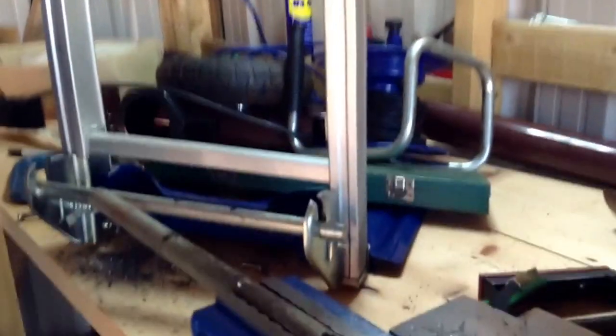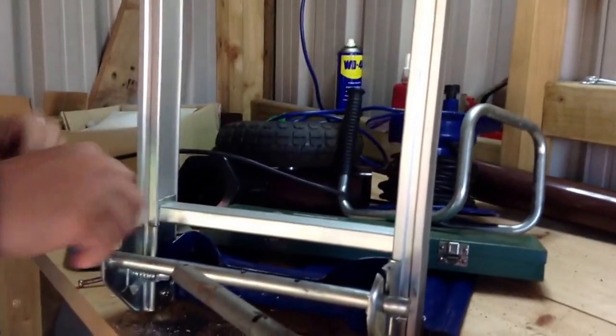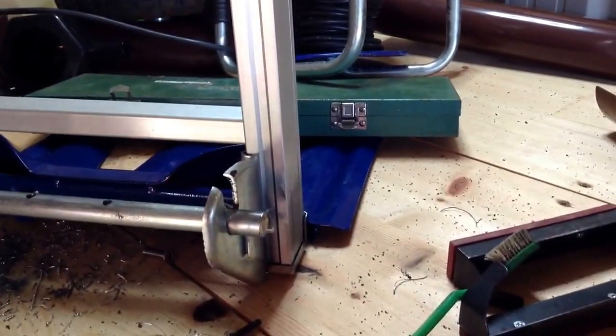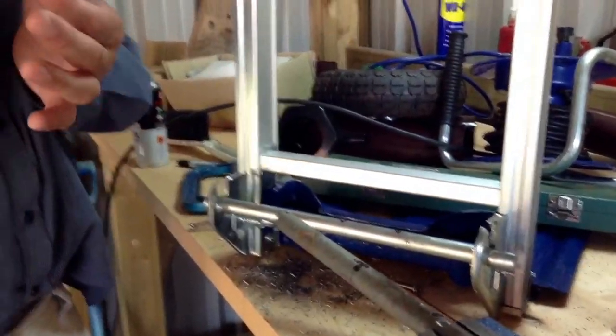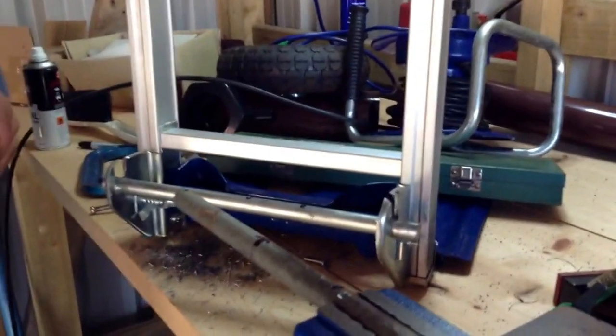If we have a look over here, it's not completed 100% yet but I'm in the process. This is the next sack barrow — exactly what we just looked at — except I've angle grinded two slots above the original axle and I've also cut the axle down. These are the bits I've taken off the end. So basically I've shortened the original axle.